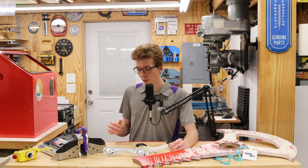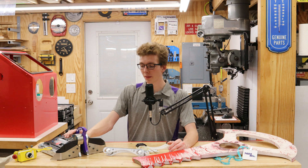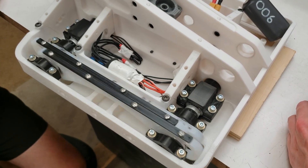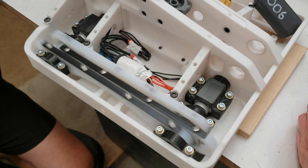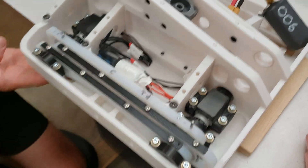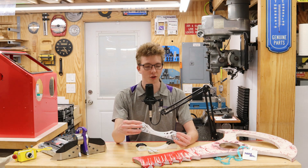Now moving on to the big change with the Kaleidoscope, which is the walking mechanism. In order to fit all these fancy features that we've added to the robot and the frame that's double the weight, we've had to engineer a walking mechanism. At Norwalk, a walker gives you a 50% weight bonus, so Kaleidoscope V2 actually weighs 18 pounds fully loaded. This increase in weight was necessary to strengthen the frame. The initial design of the walking mechanism used three feet with multiple pins on the inside and machined aluminum cams to create a dual-stage triple-foot walker. Our original idea was to put grip tape on the bottom of these feet — these are just machined out of UHMW on the Bridgeport.